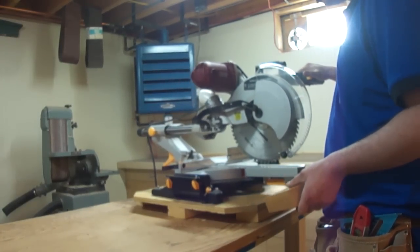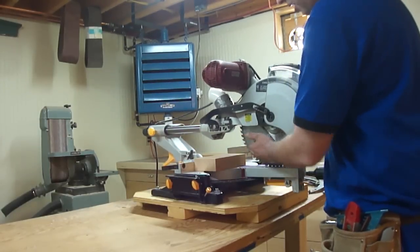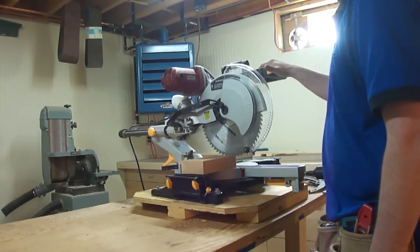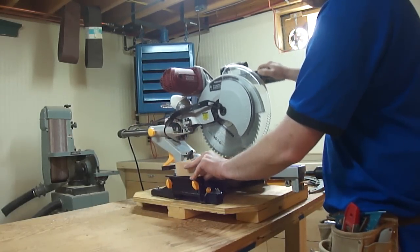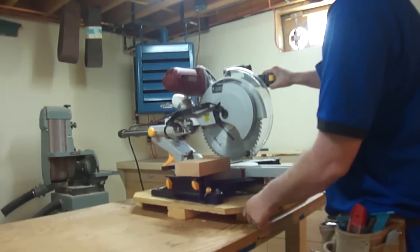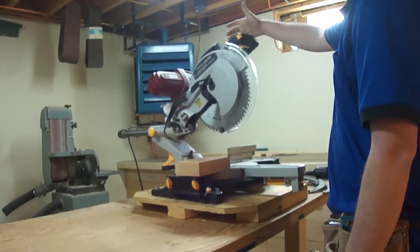With the radial arm saw, you turn the saw on and it's sitting there spinning the whole time. So you're not trying to position the wood behind a spinning blade. The other reason is this has a hinged head. Like I said before with the radial arm saw, if the saw's arm has a lot of deflection to it, it can try to ride up over the workpiece and help propel itself along. Well, this is really going to do that because it's spring-loaded. It's already trying to push itself up.